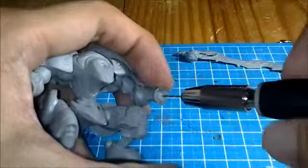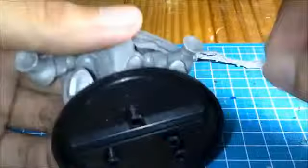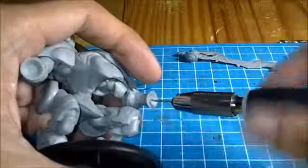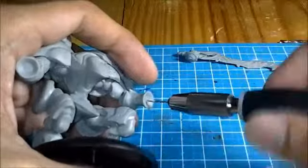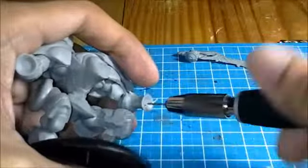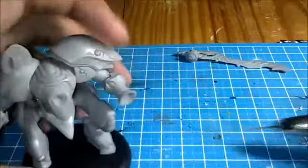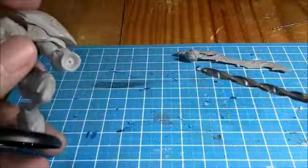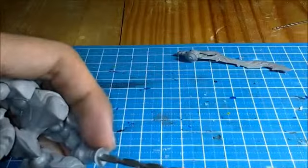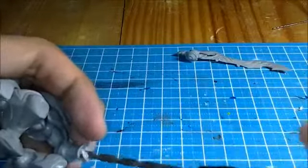When you're drilling, you'll notice that plastic shavings get everywhere and you stop making progress. You have to clean the piece — just wiping it off — and the drill bit as well, then keep drilling again. Once that hole is deep enough, we'll switch drill bits. I'm now using the 1/8 drill bit to widen the hole to the correct size.